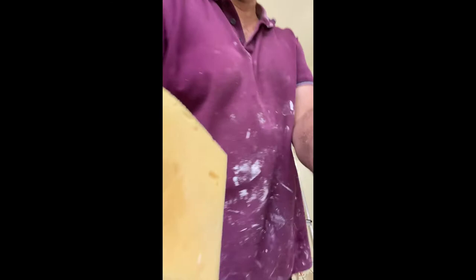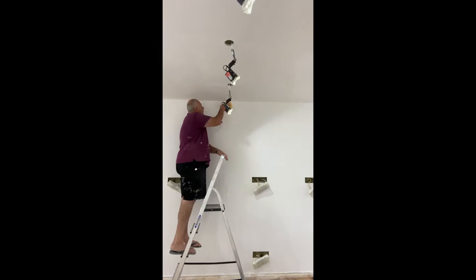See now, the ceiling is painted. And I'm just slowly peeling off the plaster. Sorry, the thingy paper. A white sponge to take off the bad parts. See that, we've taken it out, just a bit more water.